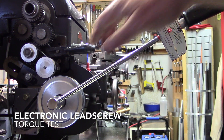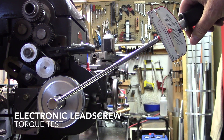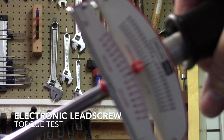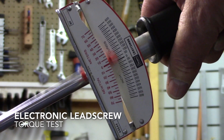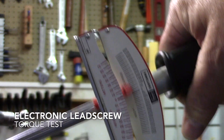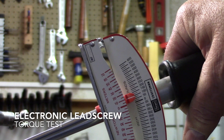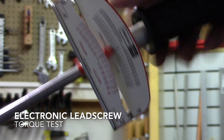Let's see how many Newton meters we can get from this motor at 5 to 1 reduction. Let me zoom in and focus... okay, here goes — let's force it through and see what we got. That looks like 10 to me — we're about 75 inch-pounds of torque. So we know we're within spec on the motor.